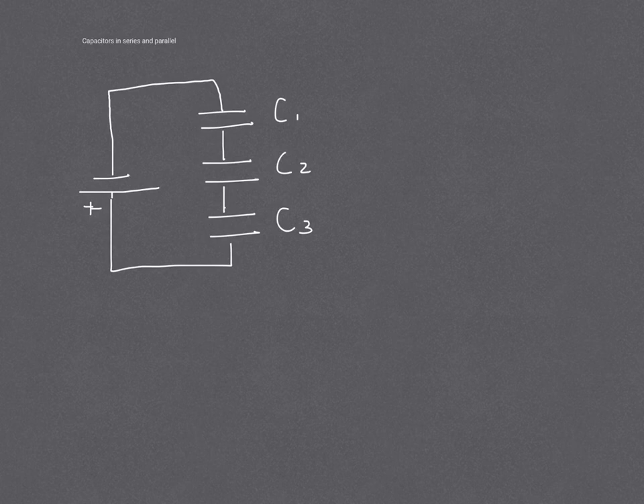So this would be when the capacitors are in series. What's going to happen is, since the positive side of the battery is here, it's going to push the positive charges through here, and they're going to build up on that capacitor right there. We have positive charges building up here — that's going to pull negatives this way. It's going to polarize these conductors right here. So it's going to pull the negatives in that conductor to this side of the plate, and leave the positives on that side of the plate, then pull the negatives in between those on that side of the plate, and leave the positives on that side of the plate. And that's going to pull the negatives from the battery over here. Since they're parallel plates, whatever the amount of charge is on this plate is going to be equal to the amount of charge here.